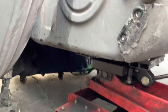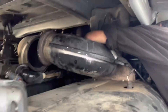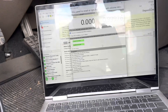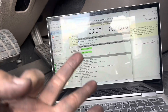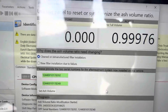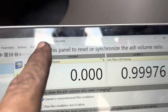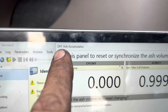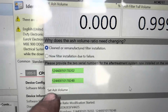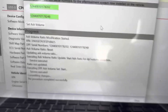That's my dad — 70 over 75 years old and still working every day! Alright, now that we have our one box assembled, installed, and connected, the next thing you want to do is connect to your truck using your diagnostic software. You want to reset your ash accumulator — go to DPF, then ash accumulator. Launch your software, input the two serial numbers, and hit 'set ash volume.' It takes a few seconds to a minute or two.